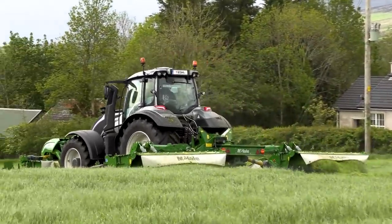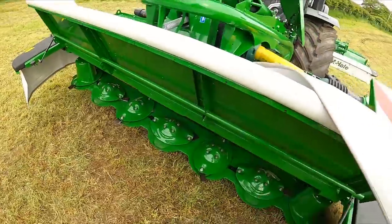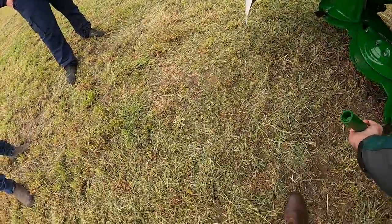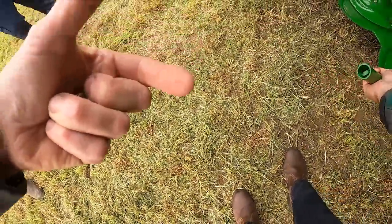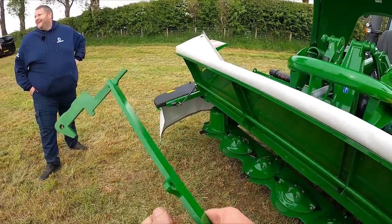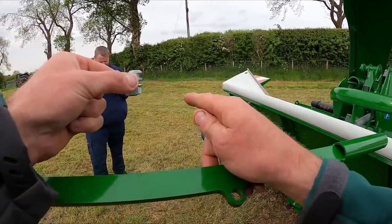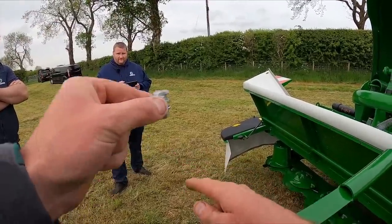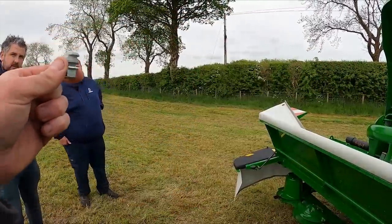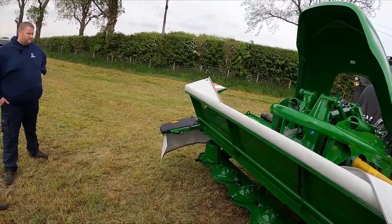All quick-fit blades are used in the mower. We use a lever on the side — which is also used as a tool for adjusting your spreading vanes — you put it under your disc and lever it down, pull out your disc and blade. The stud for holding your blade is a cam-type stud. We sell these mowers in a lot of different countries with different conditions — sandy soils, stony conditions. With the cam-type stud, your blade won't flip off in stony conditions. When you open your lever, you need to push the blade back and pull it out. It's a simple idea but based on feedback from customers in different countries.